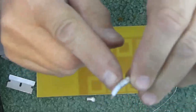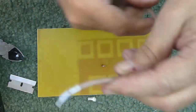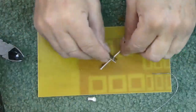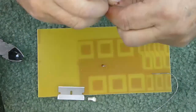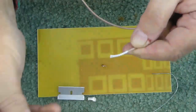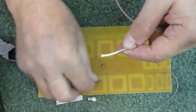That's all you have to do when you're prepping Teflon coax — it's real easy to work with. Here's a tiny piece and it's the same way. I can just take it and roll it, or roll the sharp knife around it, and peel the jacket off.